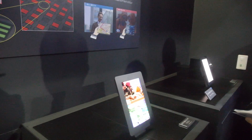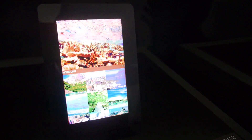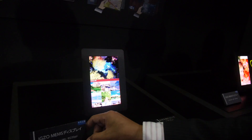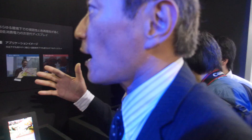The shutter simply controls whether the backlight is blocked or transmitted. This is the first time showing MEMS in Japan — it was previously demonstrated at SID in Vancouver. How is it different from LCD? It doesn't use a color filter and doesn't use a polarizer, which contributes to great power savings. Even though it refreshes 1000 times a second, it actually targets 50% of the power consumption compared to LCD.